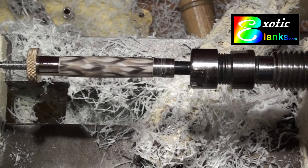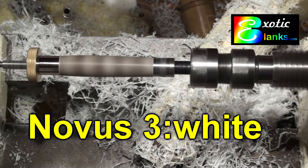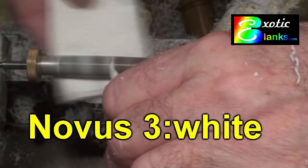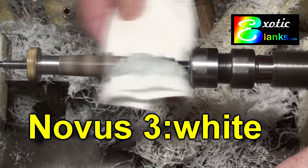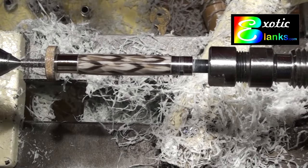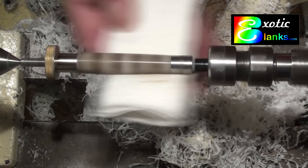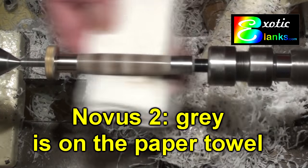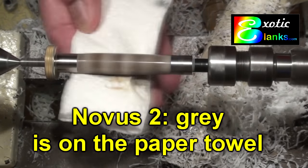At the end of this video I've added a list of the things I hope you understood — the important takeaways to post on your wall if you need to. You shouldn't need to use water with this stuff. You shouldn't use your pen mill on it. Make sure that you don't have crud in the tube. These are the things I generally get as phone calls about — my pen doesn't work, my blank didn't turn out right, it separated. These things are not difficult. The blanks are very well made, and if you treat them with any respect whatsoever, you will get a very nice-looking pen.